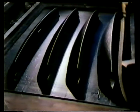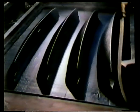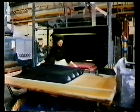Before evacuation, the sheet is first blown up and drawn down onto the forms by the vacuum which has then been created. Fine water sprays are used to increase the speed of cooling so that the sheet can be removed as quickly as possible. Vacuum forming, unlike the other processes we've already seen, is different in that the polymer has been softened to a rubbery state, but not melted.